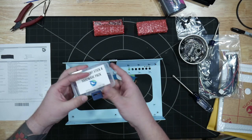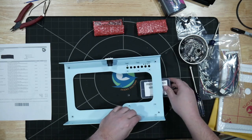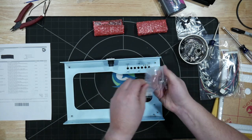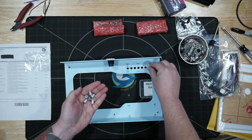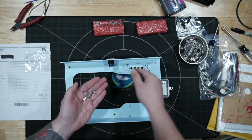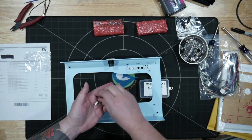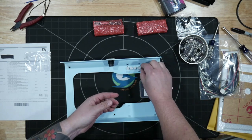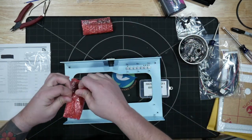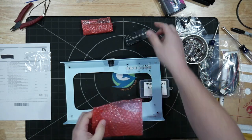All right, next thing we're going to do is I'm going to use this little box here. This is a trick I've picked up over the times. I'm going to just latch it back. Why isn't it shutting? There we go. Latch it back. And I'm going to just prop up the Panzer like this, because what we're going to do is we're going to take these aux buttons here, and then I'm just going to drop them in place like so. And by propping up the stick, it lets them fall all the way, and you're not going to fight them when you try and put the aux button board back in. All right, cool. And then we open up the aux board. And we're going to install that.